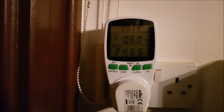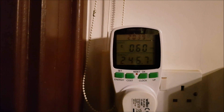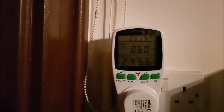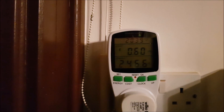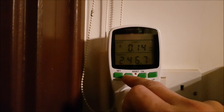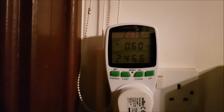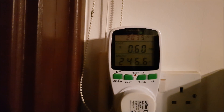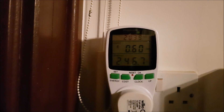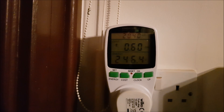This is my new electric meter rigged up to the air source heater outside so I can see how much energy it's actually using. I got it off Amazon for about £14.99 - you can program in how much you're paying per unit for electricity. I'm on 14p a unit. Pressing the cost button: it's used 60p today, from about half eight or nine o'clock this morning until now - about 20 to 9 at night - to heat 4,000 litres of water from about five or six degrees up to 12 degrees. The pond is heavily insulated so it's holding the heat well.